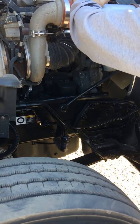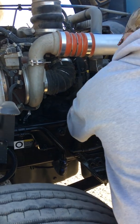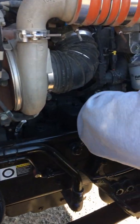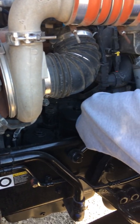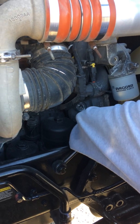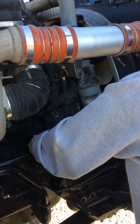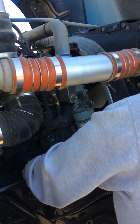I'm going to talk about my other hoses and clamps. Right here I've got a belt-driven water pump — no loose or missing bolts, secure and tight. My hoses and clamps are secure and tight and do not leak. Since it's belt-driven, I'm checking my belt. It's not worn, torn, or frayed, and no more than a half to three-quarter inch of play on that belt.